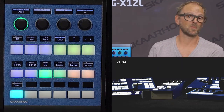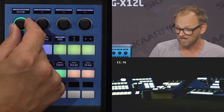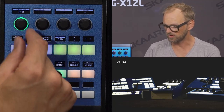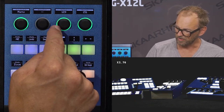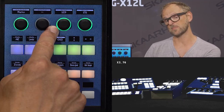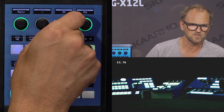Moving on to the white balance menu, you find white balance features like auto white balance — which is the current selection — indoor, outdoor, one push balance triggered by pressing or turning this knob. If you go to the manual white balance, you have red gain and blue gain. These numbers are actually picked up from the camera. In manual mode, I can now adjust them — turning this knob affects the red level of the white balance.